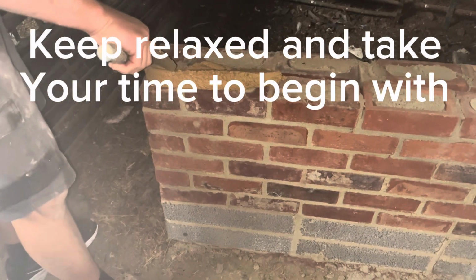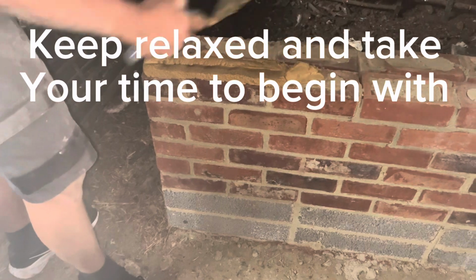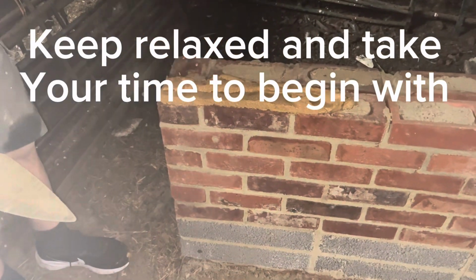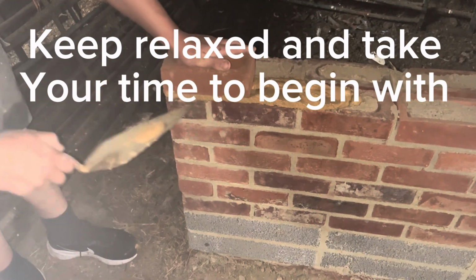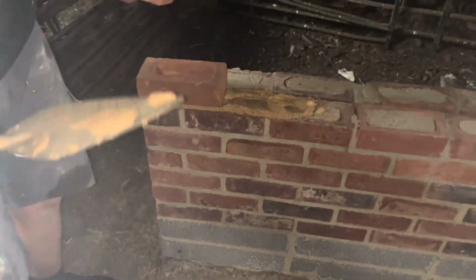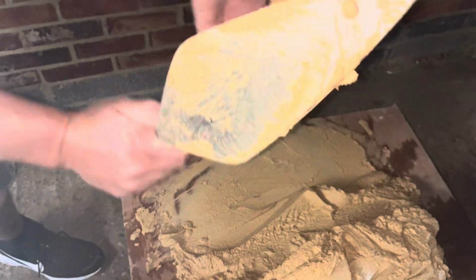Then you pull the back in, you go over the top to flatten, and then you feather through. And then what you should be able to do is sit that on there and be done. Obviously these bricks have been reused, but when you've cleared it off, you should have a 10mm joint like that. Now, once you've got to that point, you've laid that one quite well. Then it's the buttering. So it's 1 down, 2, 3.